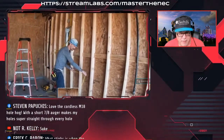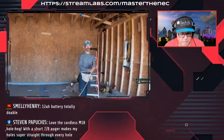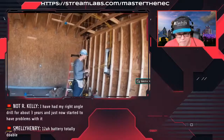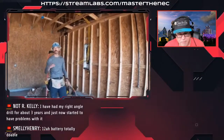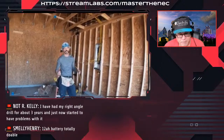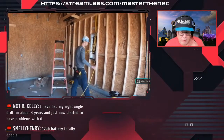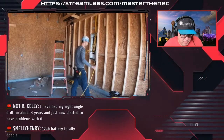Okay, so I'm going to back up because I was running my mouth here. I want to hear what he just said. This is going to be for the garage receptacles, and usually I do that in 14, but 2020 code change says that it wants all the garage receptacles and all the outside receptacles on one GFI in the garage. Okay, so I'm not sure which code he's talking about when it comes to all the GFIs.